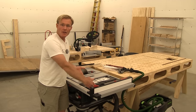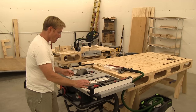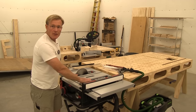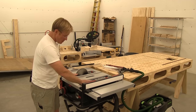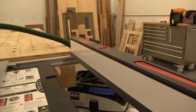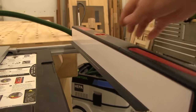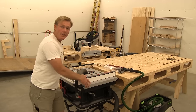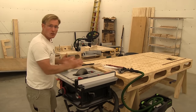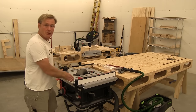That leaves a bit of a gap — airspace — where if I'm using a wider cut and the fence is in that space, the material could tip down. So what they've done is create a lip extension that, with just the twist of a knob, comes out to support the material. To go back to narrower cuts, you slide it all the way back. There are only two positions: all the way down or all the way out. That keeps your tape calibrated.